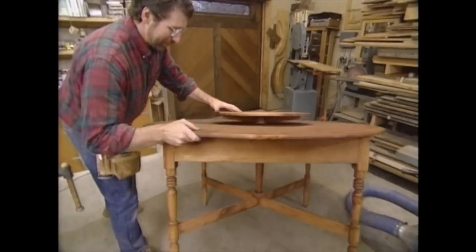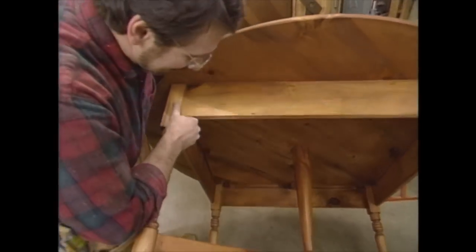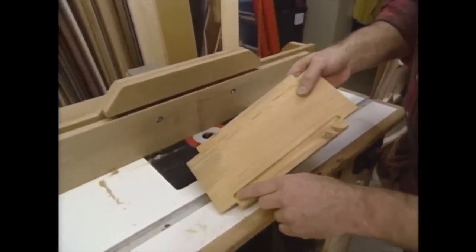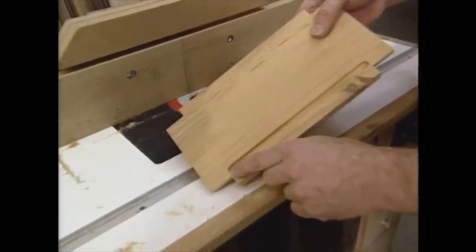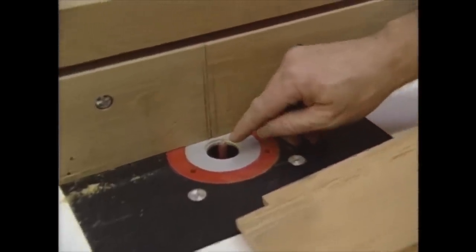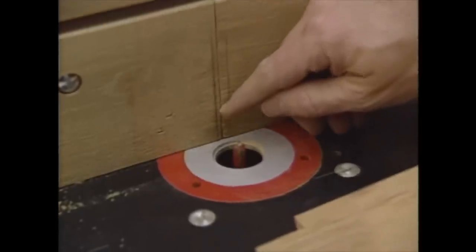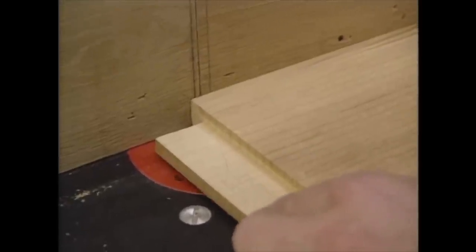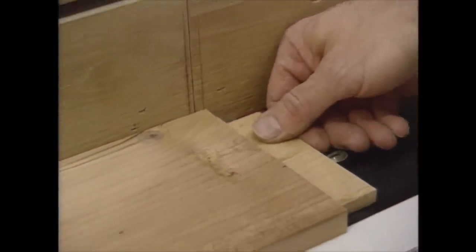Let's take another look at the prototype — I'll tip it up so you can see underneath the top. You'll notice I've attached the top to the base with some wooden clips, and those clips sit in a groove in each rail. I'm going to make that groove next at the router table. I don't want the groove to go through the tenon because it'll weaken it — I want it to go from shoulder to shoulder. I've set up a three-eighths inch straight cutting bit and transferred lines back to the fence for the leading and trailing edge. I just drop the piece in over the bit with the shoulder line on the pencil mark, push it through, and lift it off when it reaches the other shoulder.